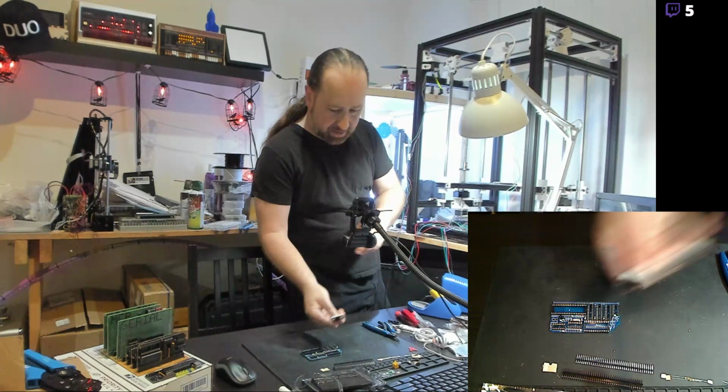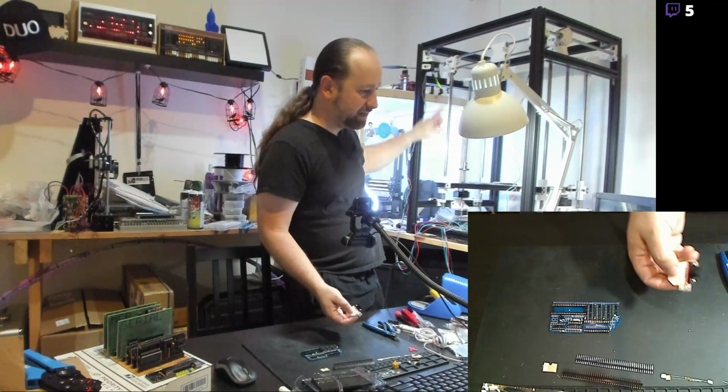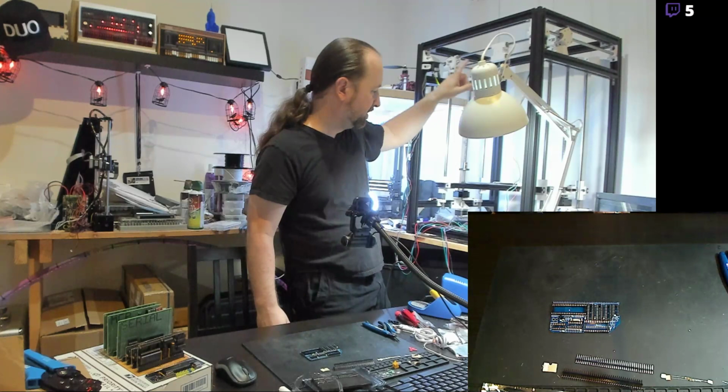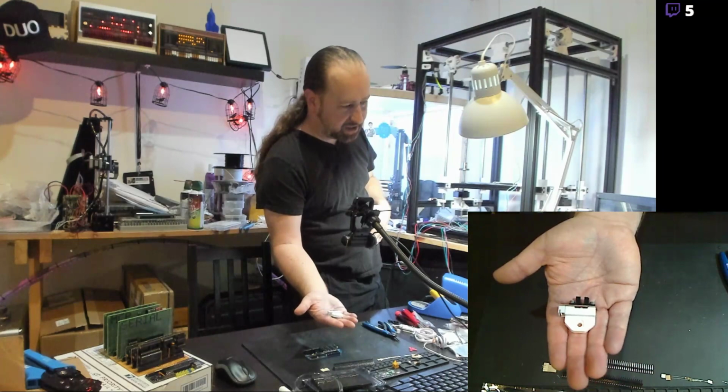But I've got quite a bunch of optical end stops, and since this is a larger Core XY machine, I actually wanted to get both Z Max and Z Min. The Z Min, of course, will be on a sensor that's on the printhead. In fact, I think I'm going to go with a piezo sensor on the printhead. The Z Max is going to be this optical. It's kind of a fail safe on Z Max. But I'm also going to put a secondary Z Min on there in case the bed actually crashes the head and goes beyond where the head should be. So this will stop it.